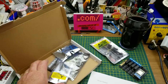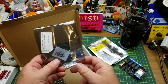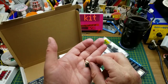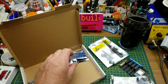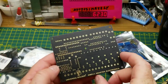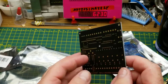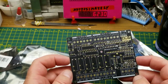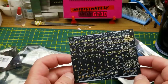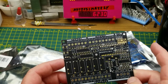This one has six relays, it is driven by a Nano, it has a real-time clock module on the board, and everything connects via nice screw terminals. As seems to be common with his boards, it uses a nice black and gold scheme with really good labeling — pretty sexy looking boards actually.